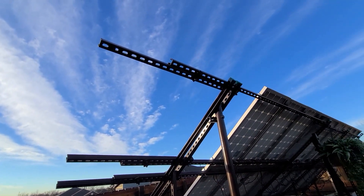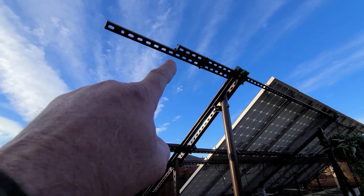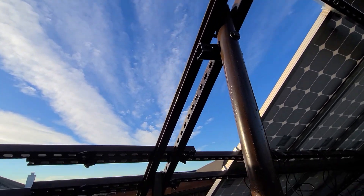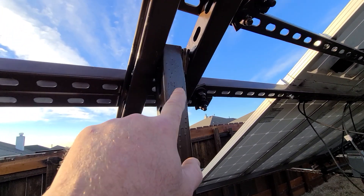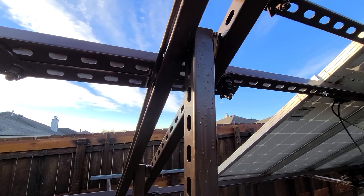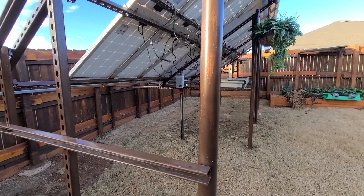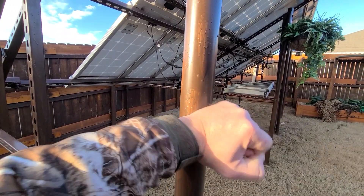Right up here I had to put extensions in to fit six of those Q-Cells. I've got hard point after hard point bolted together — a strap there, two bolts there, and another strap right up there. I also sandwiched these two angled pieces together with spacers and painted them, so these two are attached solidly. I put that extension in there for weight distribution as well. It's a pretty stout and solid array — this is a concrete-filled stockade post.